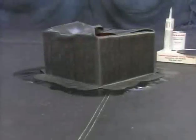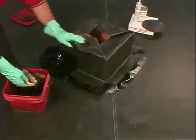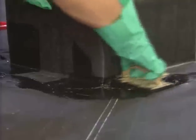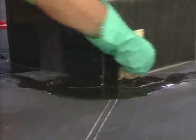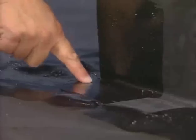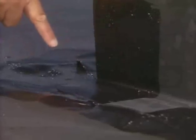Ensure the liner is dry and free of mud and other contaminants. Using a scrubber pad and holder, apply Quick Prime Plus Primer to a 14-inch by 14-inch area of the corner. Test the primer flash-off by touching the primed area with your finger and pushing forward at an angle. The primer should not string as your finger is moved up and away.